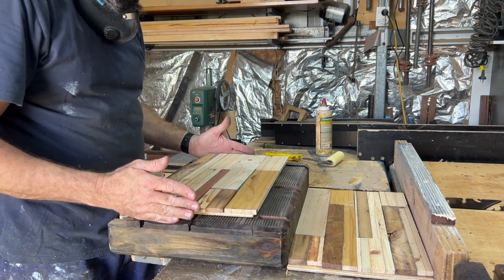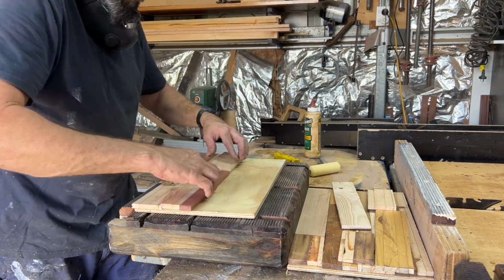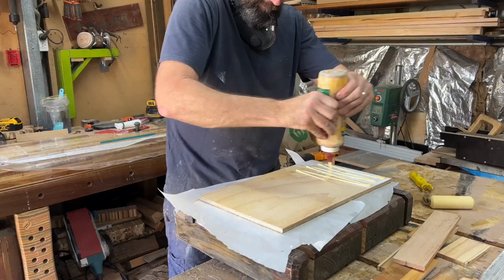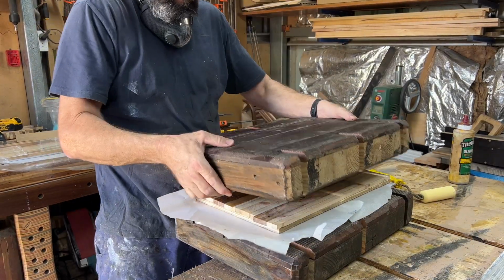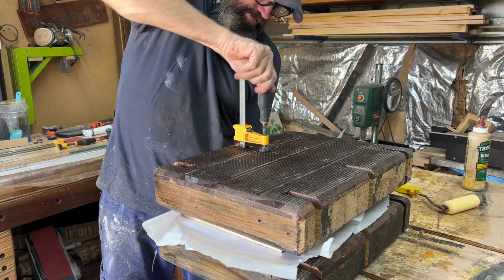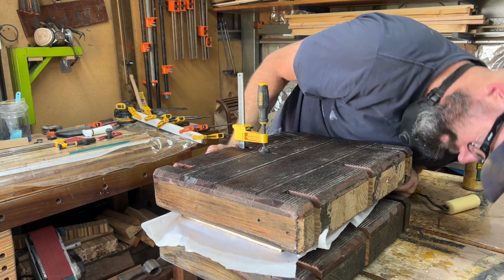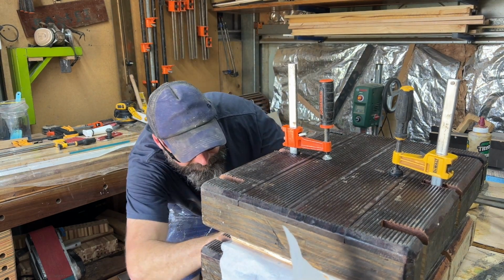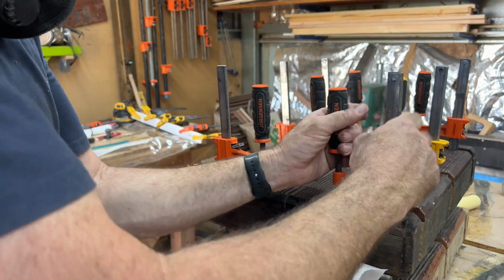So my second clamping technique is just using a press. So I've got these big chunks of wood, which I call my pony press, which the reason they're so chunky is I combine these with some heavy duty sash clamps that I use to press broken skateboards together, which do need that additional pressure to encourage those skateboards to bend and become flat again. However, just using a couple of chunks of wood and say half a dozen F clamps, you've got yourself another way to clamp up all sorts of stock. And again, as long as nothing moves, it works really well.